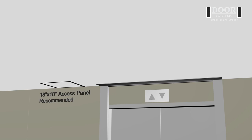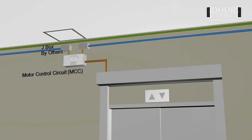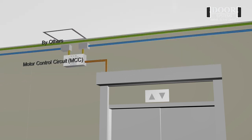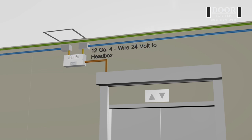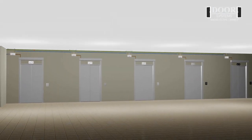The Motor Control Circuit, or MCC, is mounted above the ceiling next to the head box. 24 volt power from the Group Control Panel, or GCP, will be run to the MCC and then directly into the smoke curtain head box, then out of the MCC and into the next MCC and head box. After the 24 volt power has run to the last MCC, the wiring returns to the GCP to complete the 24 volt power loop ring circuit.